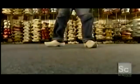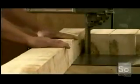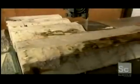Most wooden shoes are crafted from poplar, a wood that's easy to carve and generally free of knots, so the wearer won't encounter any splinters. A worker feeds pieces of poplar into a bandsaw, careful to toss any pieces with defects. The blade slices the wood into blocks called blanks.